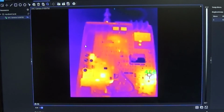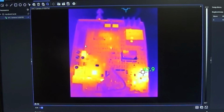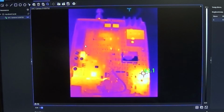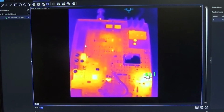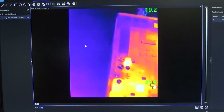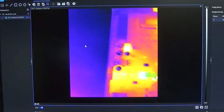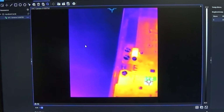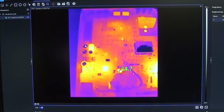infrared cam. And if we have swapped out components, we want to make sure that nothing is overheating. So for instance here our voltage regulator with 43 degrees C is really good. If it would show up 70 degrees, for instance, then we would know something is wrong. Or our MCU, it is an MCU, is here showing approximately 32 degrees C, and that is completely fine, no problem whatsoever, right?